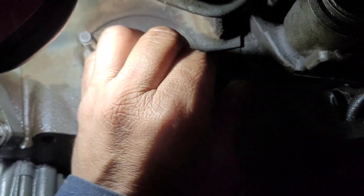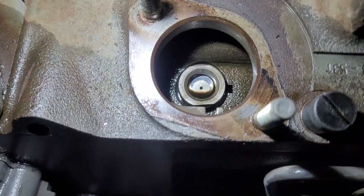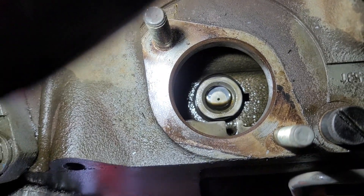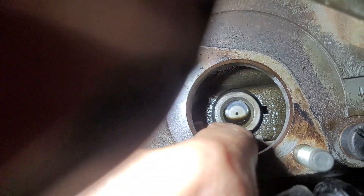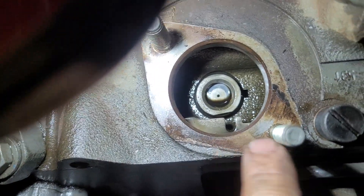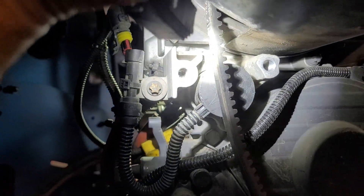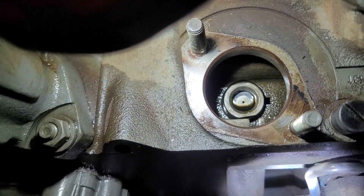Make sure the slot is all the way in. You may need to loosen the shutter valve a little more. Once you have a perfect timing position, you'll see that the slot is in the middle of the plate - that means you're already at the correct timing. I've now properly set the timing pin. Look at the slot on the plate - it's already in the middle. Just loosening these two bolts on the shutter valve solenoid and letting the plate have free play is what allows you to insert the timing pin.